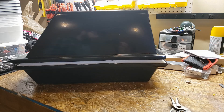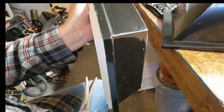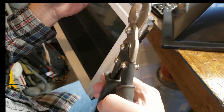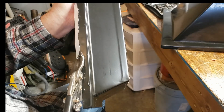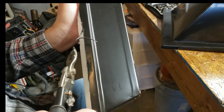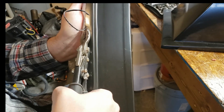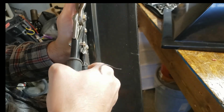Now as I'm going over this with the tin snips, your frame needs to be glued into your shell. What I do is take the tin snips and glide around my frame, letting that be my guide so I don't cut down too far. Go in there and trim out as much as you can, because you don't want to have to sand all day long — you need to take away some of this extra material so you're not sanding forever and your hand doesn't start to hurt.